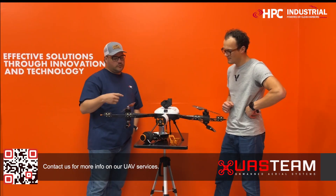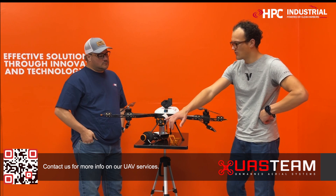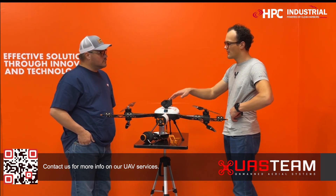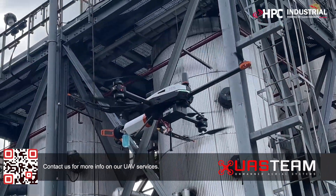Can you tell us about the different probes? That's the ultrasonic thickness probe — it measures wall thickness on the material. It's a conventional UT probe at the front, and it uses this blue gel that comes out at the front to take those readings. It works similar to a handheld device, except you've got the robot making it work for you, with similar resolution and accuracy of 0.004 inches.